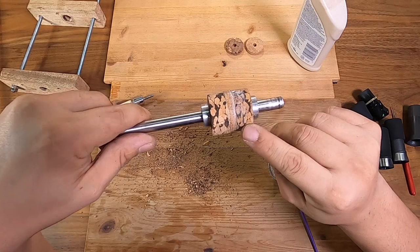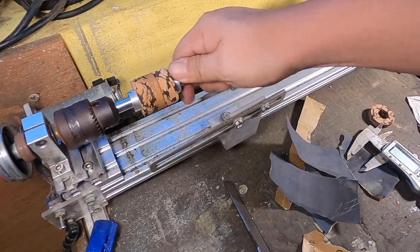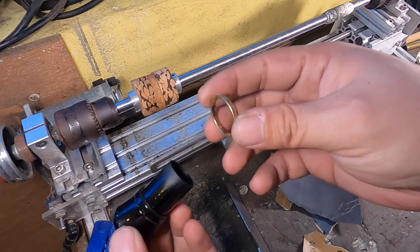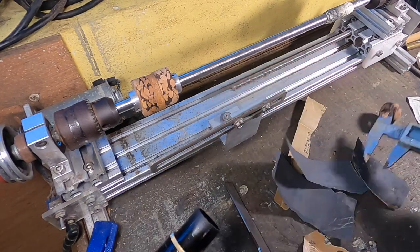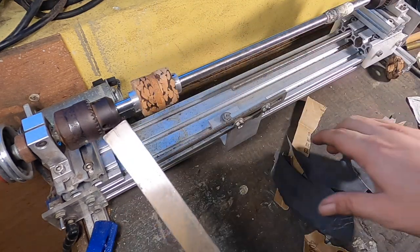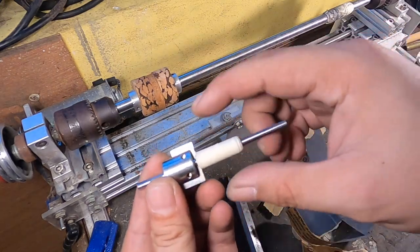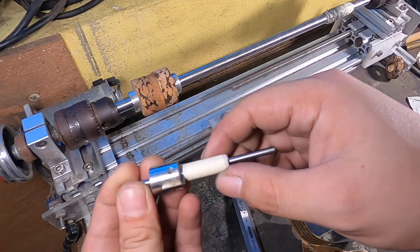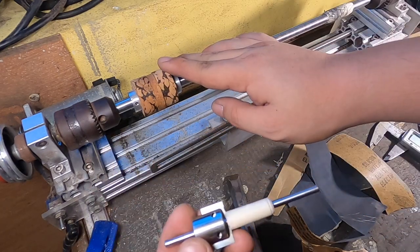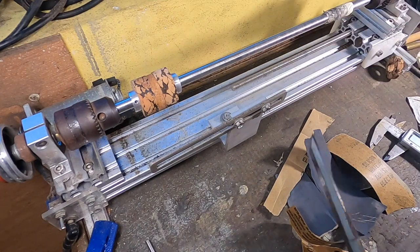It's clamped on the mandrel, been glued up, and I've cleaned off the glue. Back in the workshop now — everything is glued and dried. I've clamped it in the lathe to cut it down to shape. Got my reel seat hood and a little trim ring to fit on. I'm using calipers to get the dimensions, cutting down with chisels and sandpaper. I've prepped the Crafty Cutter with the number three blade and wrapped the shim with masking tape so it fits the 3/8 mandrel. Now I'm going to cut this cork in fast motion.